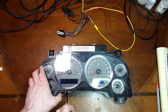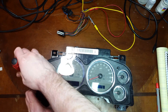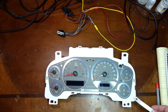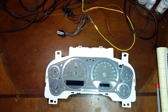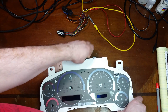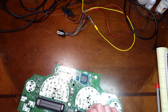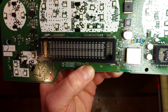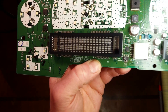I've already removed the fasteners from the bottom, so we'll just go ahead and dig in. I'm expecting the typical blown MOSFET. Sometimes it's just a solder joint that fails — if that's the case I still replace the MOSFET anyway — and sometimes a MOSFET just blows its guts out. Let's see what we got here. And here I see a hole already. There's a MOSFET that is in charge of the vacuum fluorescent display, and as you can see, there's a blister in it. Definitely the MOSFET blew.